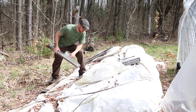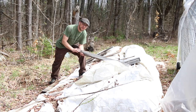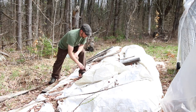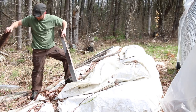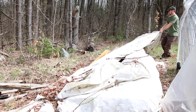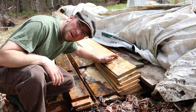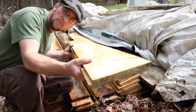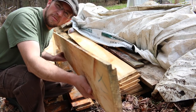If you don't remember exactly what we have over here for wood — this bundle right here is leftover siding, and then this other bundle is leftover pine boards from when we did the inside of the house, and that's what I plan on using for making the decking. I'm gonna have to go through it and see what we can use. I'm hoping I have enough of this shiplap board to make the decking, and then we're gonna oil both sides with a penetrating oil to keep the moisture out so it won't rot.